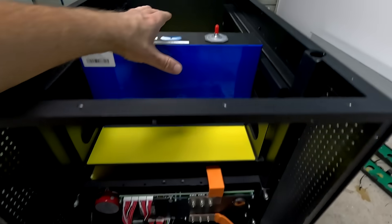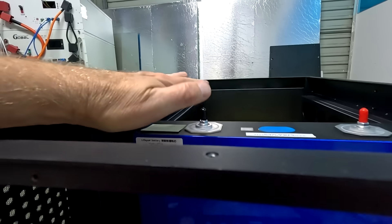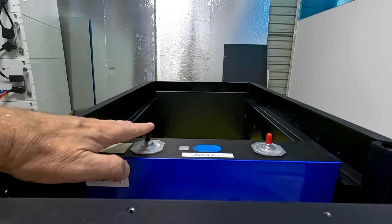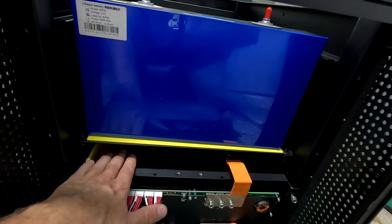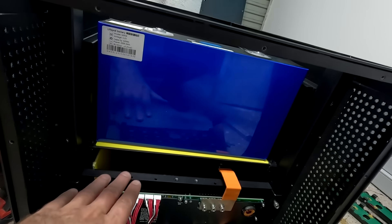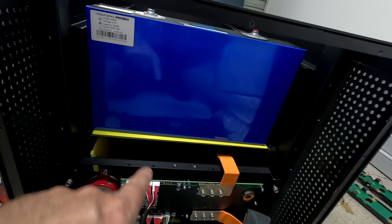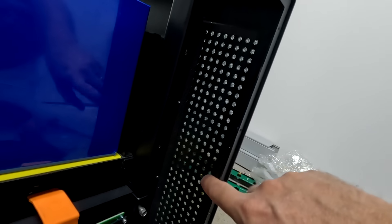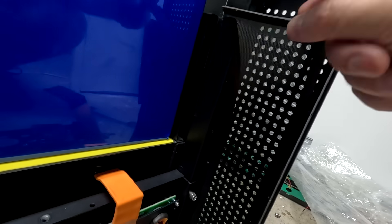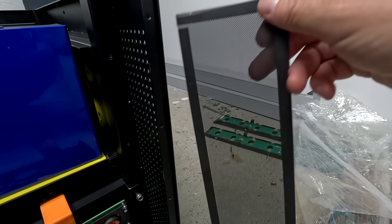Here's the MB56 cell on the top floor - it would be sitting like this, and there's not too much space up here, but we now have the epoxy sheet on top covering all the bus bars and terminals, which I like very much. When you build this battery, ensure the bottom stack is 100% ready - everything torqued, marked, all bus bars in place, all balance cables connected, double and triple checked. Because if something is wrong down there, you have to take out all the batteries and the floor to access the lower compartment. I've noticed they now have insect screens on the inside, though they should really be on the outside so you can clean them easily.